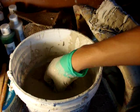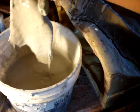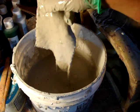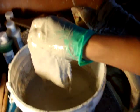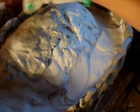You're going to dip it, soak it in, and see how it drips a bit. When this happens, don't take out all the plaster by draining it. When it's dripping like that, put it automatically on the mold itself. When you do that, make sure you press it, but don't drain it. Make sure you press it so you can get all the air out, and do it again.